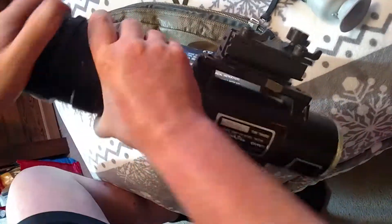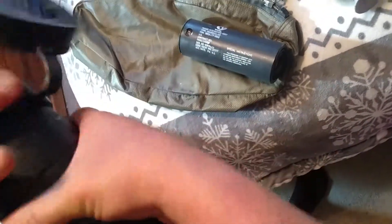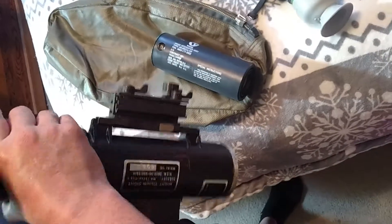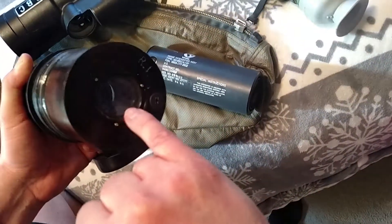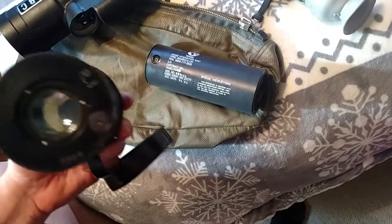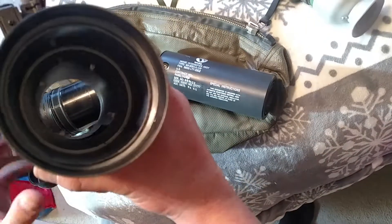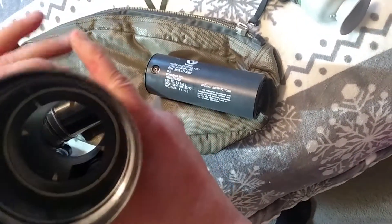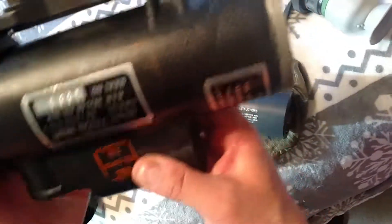As I said, there is not a whole lot to these scopes, so there should be absolutely no fear diving into them. There's really nothing you can do to break these — except for dropping the image intensifier tube. Also, when you do get it apart, it's a good idea to pop this off and clean that surface up really well. All the ones I've seen have a nice coating of dust on there that really fogs up the image. Those little tabs are what come in contact with the image unit to ground it to the assembly.